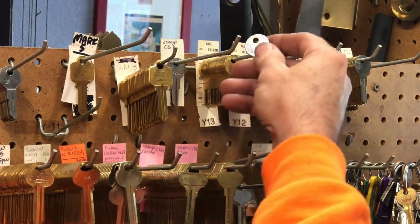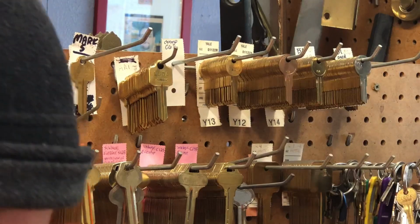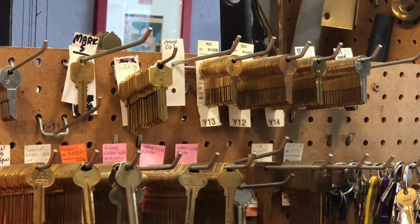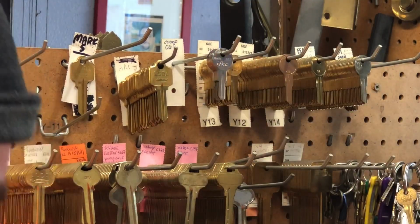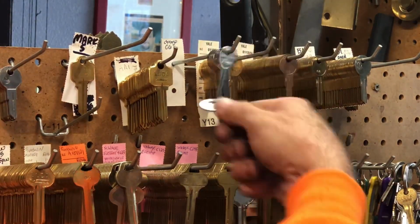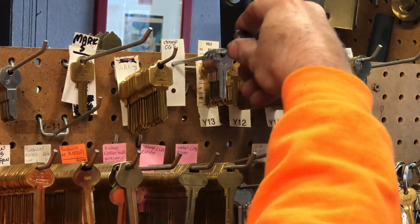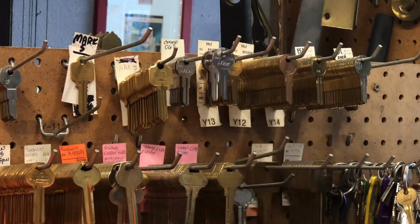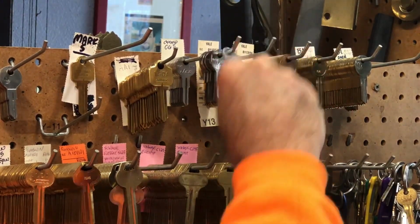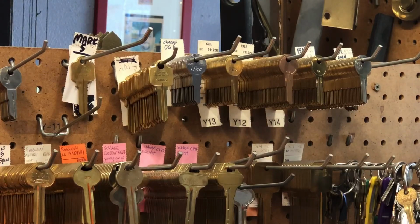Alright, and we'll put these keys up. So, you can use a Y11 for a CG16, no big deal, but we do like having the option when it calls exactly for a CG16. We do like to furnish the exact key for whatever we're doing at the time. Get up there. So we don't really buy these in 50 count anymore, like Y11s, because you can use a Y11, but you can't use a CG16 for a Y11, so better to keep a small quantity of these and a bigger quantity of Y11s.